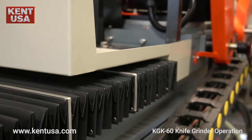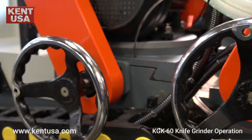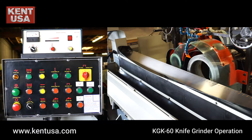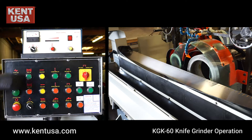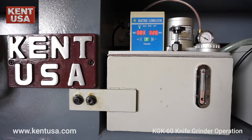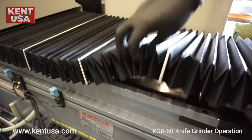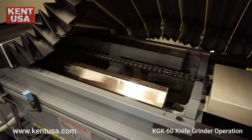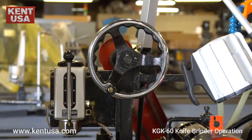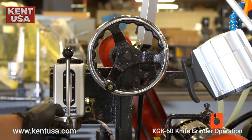Make sure that the ways are properly lubricated before running the machine. Turn on the auto lube unit a few times by performing this sequence: release the e-stop, press power on, turn on the chuck controller, switch on the magnetism, press the magnetism on button, and press the green table on button. The auto lube unit is set to pump way oil for three seconds every 20 minutes. Visually inspect the table ways by lifting the way cover. The cross ways has a one-shot lubrication system — manually pump it a few times and visually inspect the cross ways for oil.